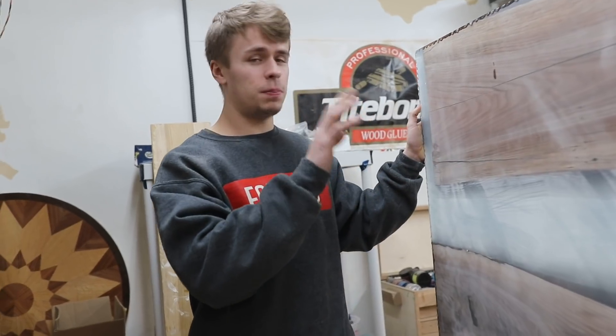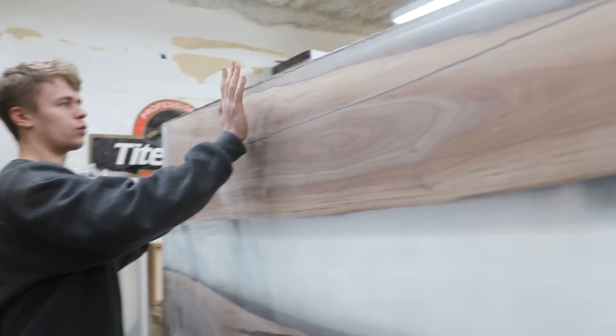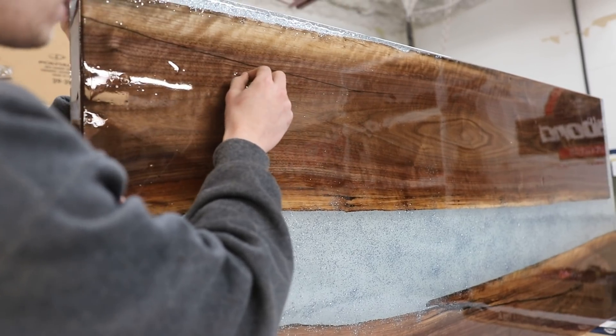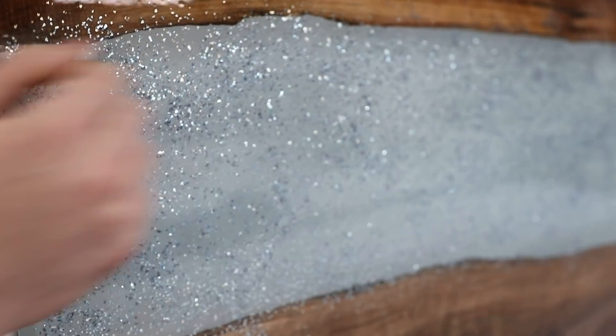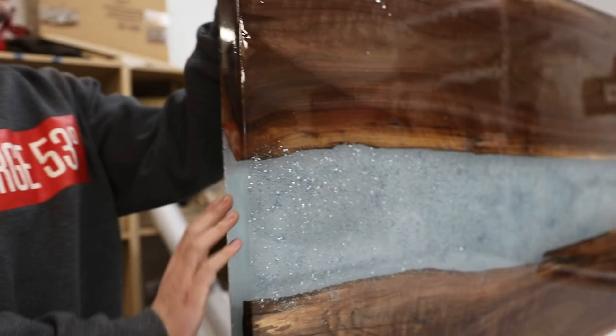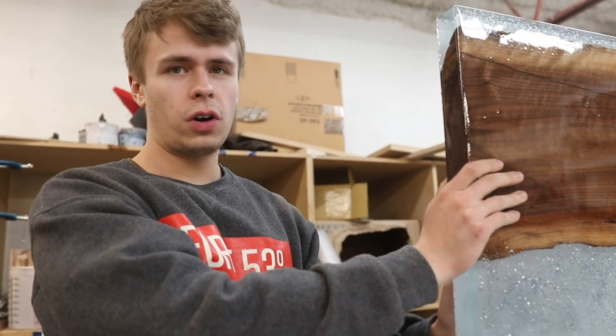What I've got here is the piece — it was going to be the layered piece, but now we're flood coating it. You can see we've got all of these drips on this side because we've actually already flood coated the other side. If we head around here, you can see we've got our layer of epoxy on here. There's still a few little dimples and imperfections, so we might end up doing one final coat just to smooth everything out. All of those mica flakes that we've put in are completely encased — you can't even feel them anymore, so there's no sharp points sticking out. Our edges are quite nice but we'll probably still do one more little sand on them. Today I'm going to be sanding off the drips and doing the first seal coat on the top side.